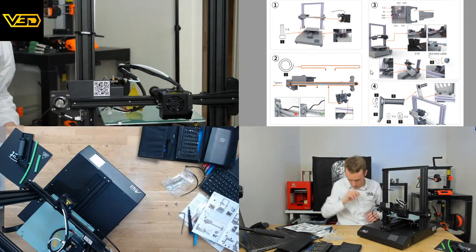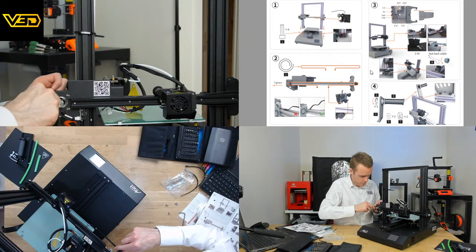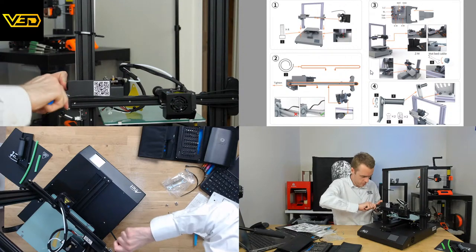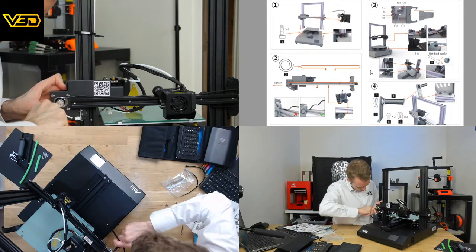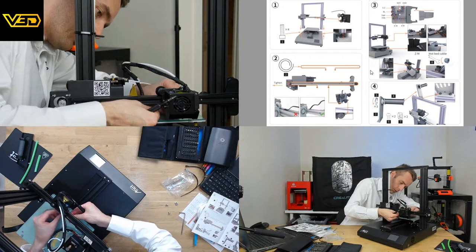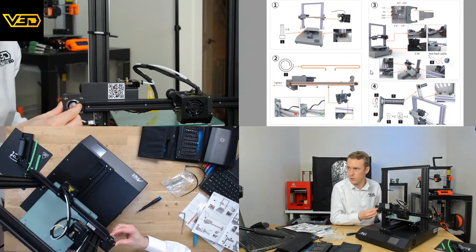There's no tensioning. Ah, there is on the motor here. So it doesn't actually mention this anywhere in the guide, but if you're having trouble assembling the belt, you can loosen these screws at the motor. That will allow this to go this way slightly and give you a little bit of extra length, which you can then pull back to tighten the belt after you put it in. Pretty naff that they've not used washers here. Really should have done. There you go. That should be enough wiggle room to get me some extra length to assemble. Oh, it's still going to be close, I think. But no, that's plenty now. Now I can pull the motor out. Oh, try not to put it off the desk though.